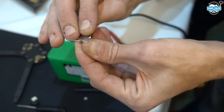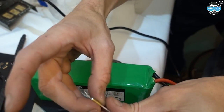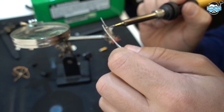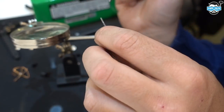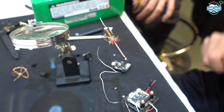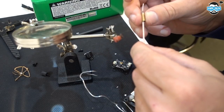You can actually buy these on Banggood - I think you get like five for a quid or something. They come as standard on a range of the little micro antennas. Then what we're going to do is pop that over there, and it'll probably be enough just to heat up that solder. It's not as easy as it first looked. I should have had this whole length of insulation to turn back - it came off with the outer casing. Normally I would ball it up into a big piece to accept the solder, but that's on. Then you want to heat shrink that and it's done.